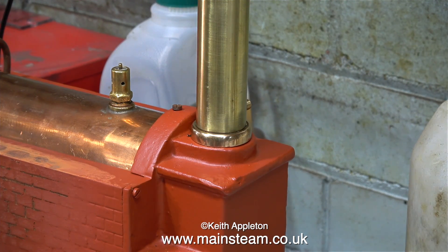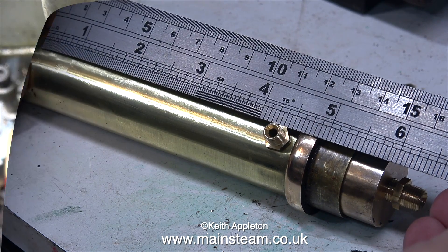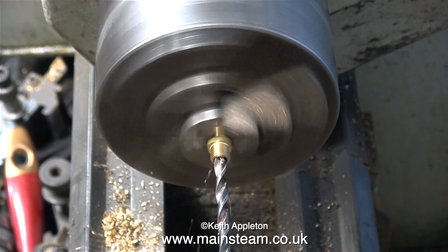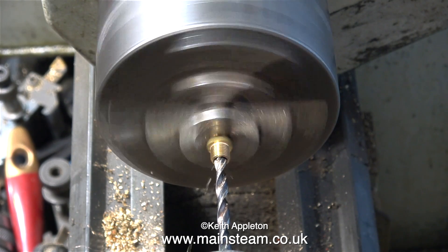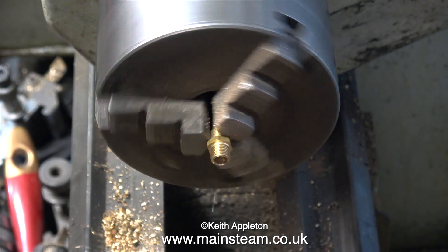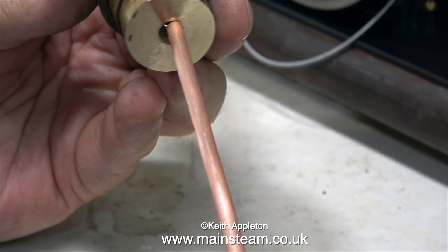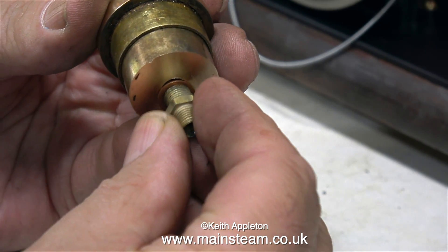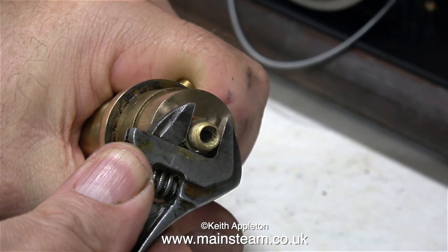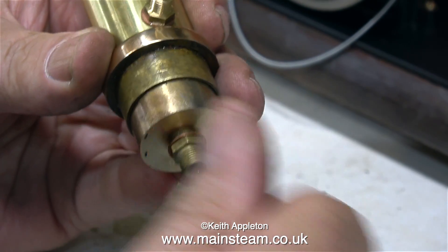Once this is done, I can sit the chimney back in the original hole in the casing, and the union in the side of the chimney will face backwards. To complete the job, I remove the bottom fitting and put it in the three-jaw chuck to drill a 3/16-inch diameter hole — not all the way through, just a little way down — then silver solder a 6-inch length of 3/16 pipe into the fitting. I'm then fitting the fitting to the base of the chimney plug using a copper washer to make sure it seals properly. This part of the plug will accept the steam pipe from the engine's exhaust.